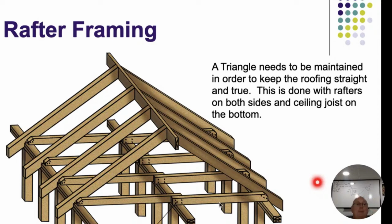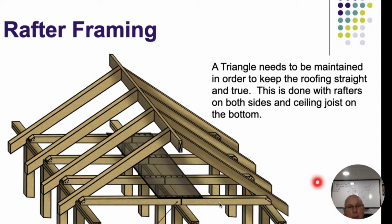What typically happens for ceiling joists, you're going to see we'll get usually around 5 or 6 nails in here so we get a lot of stress support. Then they're going to overlap and let them run wild in here. And then again, at least 5 nails or more holding these things together. That's one option. Narrower, smaller houses, they may go with the continuous board.